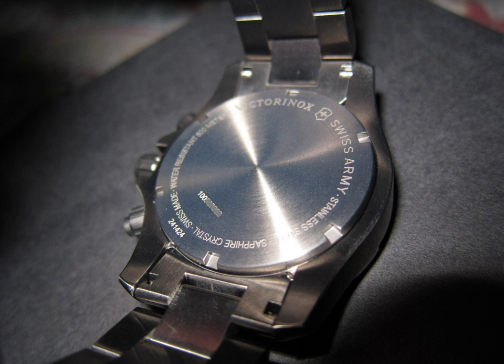The standards and features for diving watches are regulated by the ISO 6425 Divers Watches International Standard, introduced in 1996. ISO 6425 defines such watches as a watch designed to withstand diving in water at depths of at least 100 meters and possessing a system to control the time. Diving watches are tested in static or still water under 125% of the rated pressure, thus a watch with a 200-meter rating will be water-resistant if stationary and under 250 meters of static water. ISO 6425 testing is fundamentally different from non-dive watches because every single watch has to be tested.